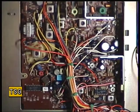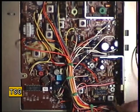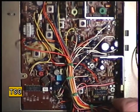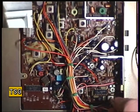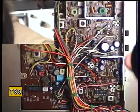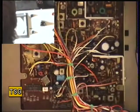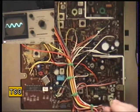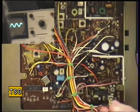Switch the signal generator to 100 microvolts and we'll just set the detector for peak. I'll switch over the camera and you can see the left-hand oscilloscope I have here. Switch — if I move the light out of the way. We'll give maximum audio; I'll just turn the volume up so you get a bigger trace.